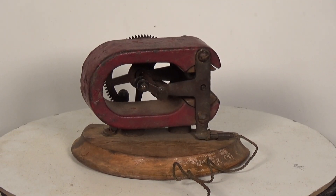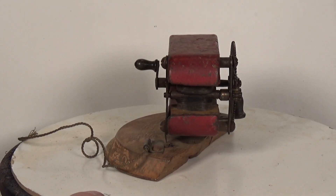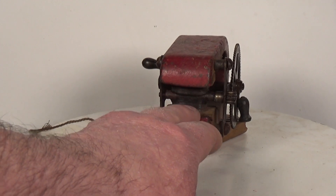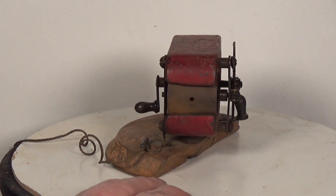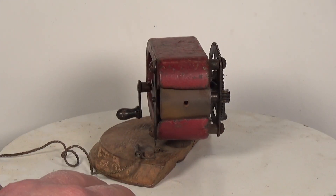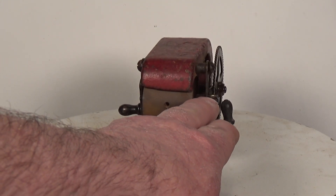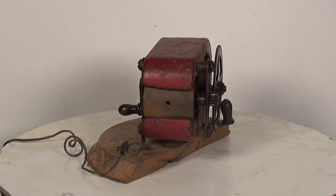The other item I got in the same lot with the Whedon electric motor was this lovely little hand-cranked generator. This is a permanent magnet moving coil generator — the coil is here, you crank the handle and it turns. I connected a meter on this cable and let it touch that slip ring, which is that little tiny piece there, and then cranked it. Sure enough we get a voltage out of it, and quite a good voltage too.